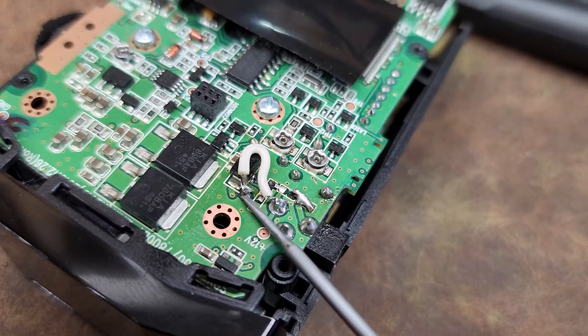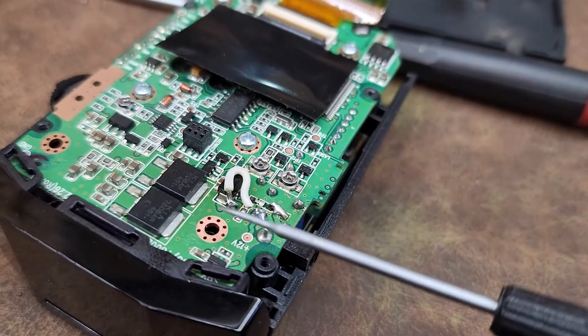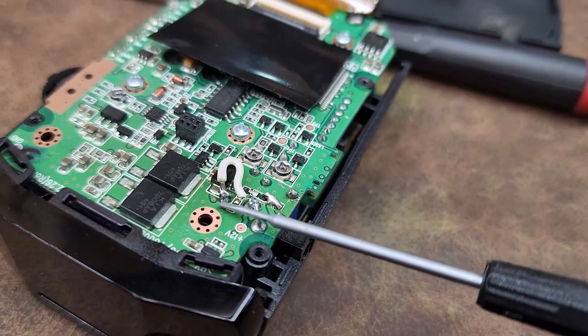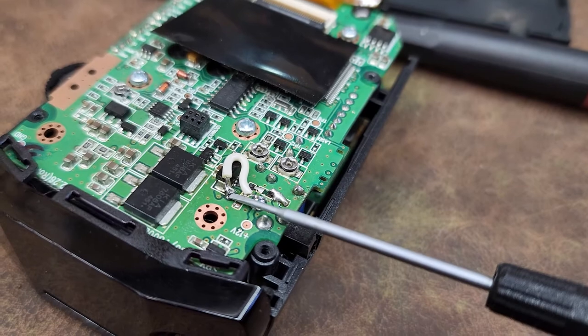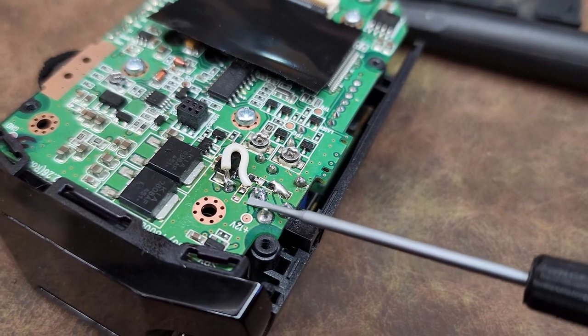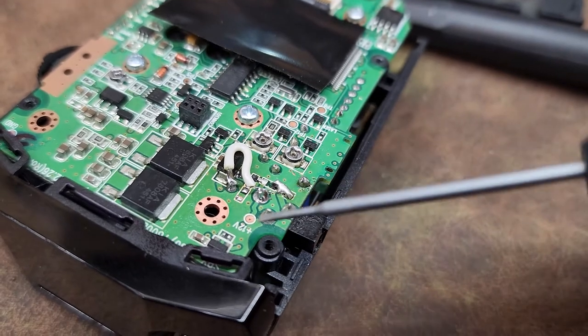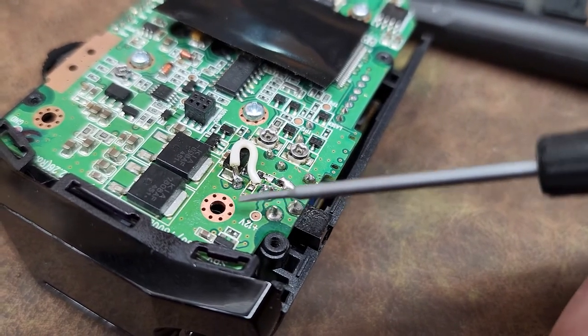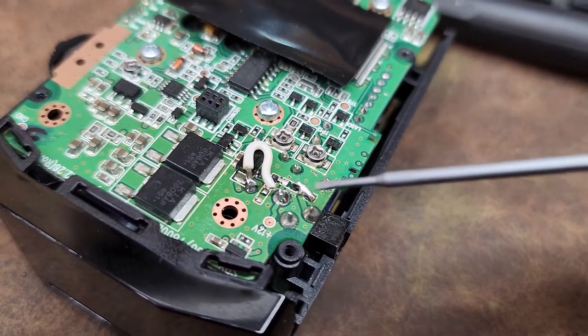What told me where the positive side had to connect was where this white wire is connected — that's one leg of the electrolytic capacitor. I checked the electrolytic on my multimeter and it came out to 220 microfarads, so since it was close to 220 microfarads I went ahead and put it back in. The short was right here at this little capacitor, which was probably a coupling capacitor between the ground plane and the positive leg. It's changed out now, so it is what it is.